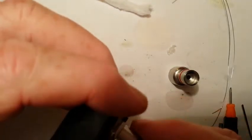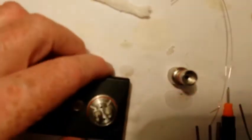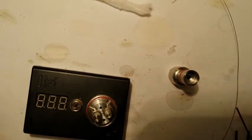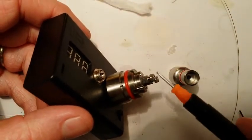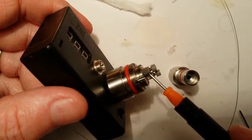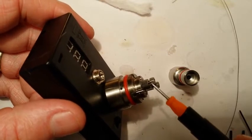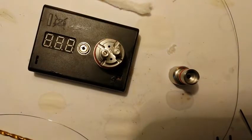Let me put this on my ohmmeter here for a building base. I've got to wrap my coils. Before I start to wrap them, you want to leave some excess on your coil legs, because what you're going to want to do is wrap the coil leg wires around these posts. There's no post holes and no tiny screws — you want to leave a little excess so that you can grab the wire and wrap it around these posts.